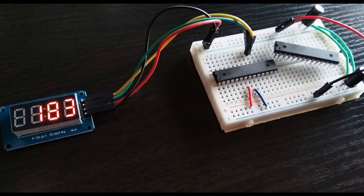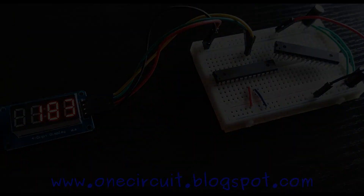The 8A is the cheaper one and that's the one I'm going to base the reflow oven around. The idea is that the 8A will measure and display the temperature, and hopefully I'll be able to use that oven to build, among other things, a PDK Padauk programmer. Next time I return to this project we should have it hooked up to the thermocouple and the oven, and we'll be able to see some live temperature measurements and hopefully some control.